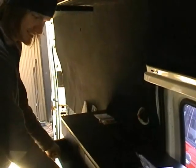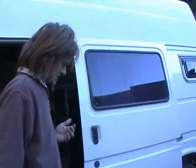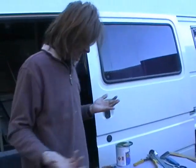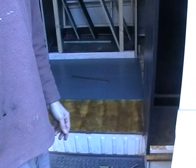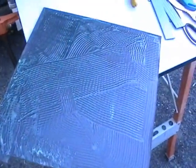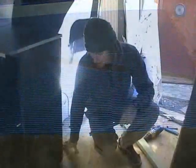Today we're tiling — putting in these beautiful spaceship-looking tiles. I'm covered in glue. First I lay the adhesive down, let it sit for 10 to 15 minutes, put it on the tile as well, and then stick them down. Starting from this corner and working my way to the back — going to look super pimped.